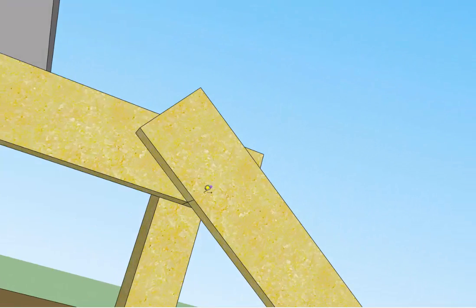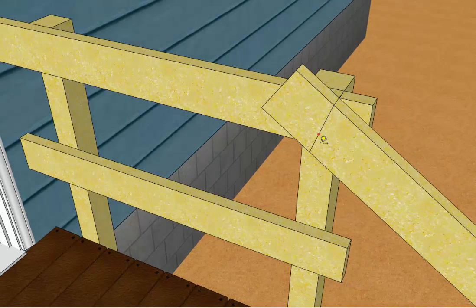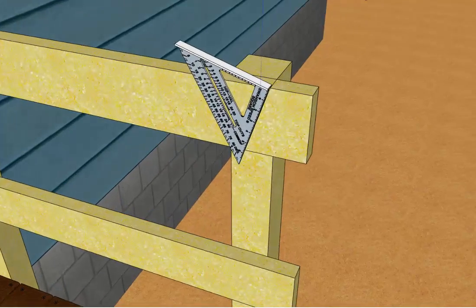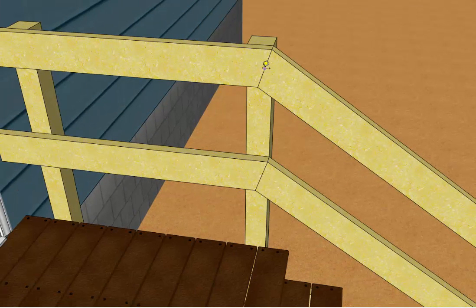Once you've done that, draw the same line down below — right where the two boards intersect, draw a line across the bottom of both boards. Then take your square and connect the dots: draw a line across the face of the rail with your square. That's the cut line, and once you cut it this rail will be ready to install. Do the same thing with your speed square to connect the dots on the rail that's already installed. You may need to remove it to cut it, or set your skill saw depth to just an inch and a half and cut it in place.